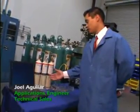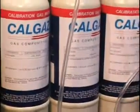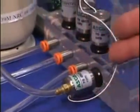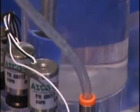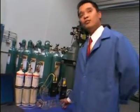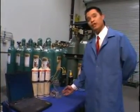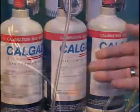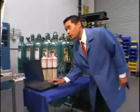We have three gases in the High-Optima 700 demonstration: 100% nitrogen, 2% hydrogen in a balance of nitrogen, and 5% hydrogen in a balance of nitrogen. Here are the solenoid relays that will control the switching on and off of each gas. This is the bubbler column — the gases will be switched on and through this bubbler column, representing a humid gas that will propagate through the exhaust manifold. This solenoid relay will switch from the bubbler column to directly into the exhaust manifold. The adapter fitting here allows us to put the sensor of the High-Optima 700 directly into the path of the exhaust manifold.